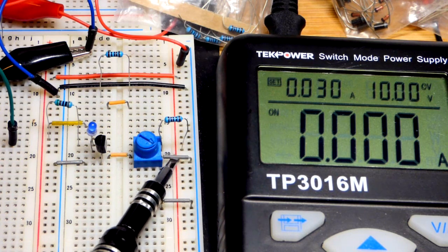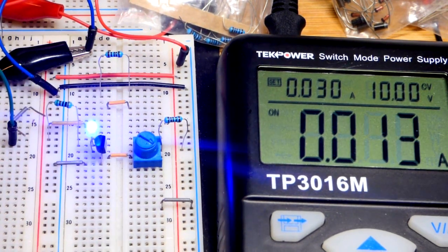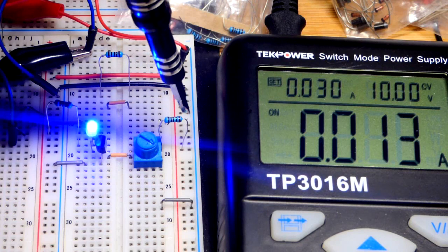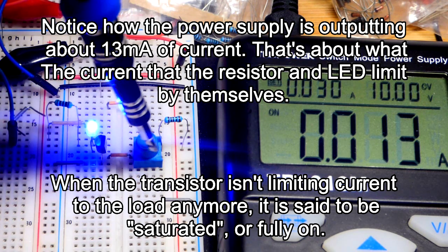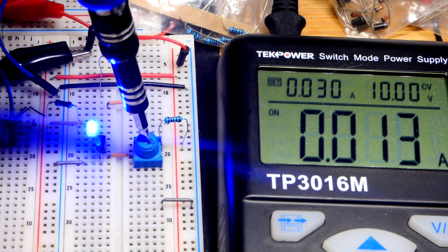Now if I pop the jumper out without short-circuiting anything, there you can see, as a variable resistor, we are no longer to the negative rail. We have 1 kilo ohm. This is a 10 kilo ohm, by the way, 10,000 ohm trim pot. So we're going through the resistive element there, and then to the jumper. And so it is not limiting current,